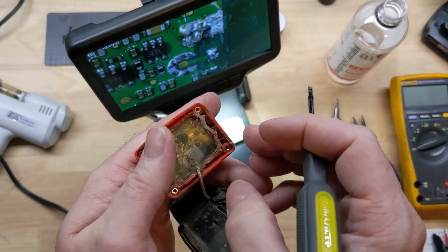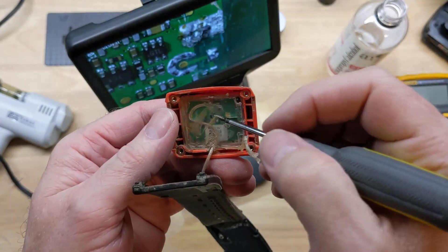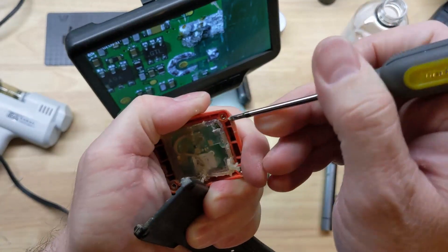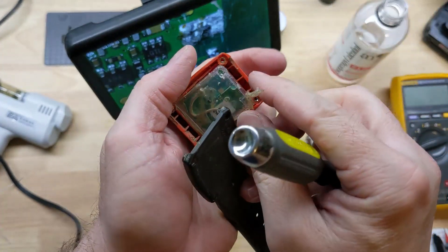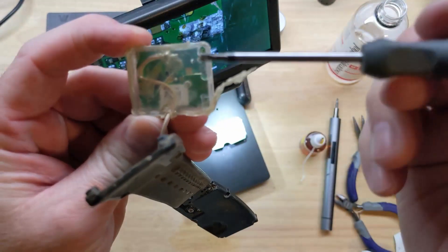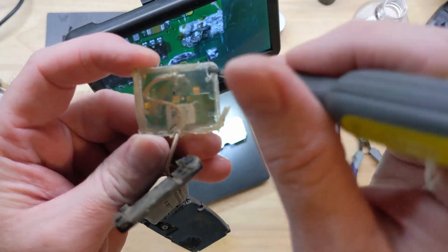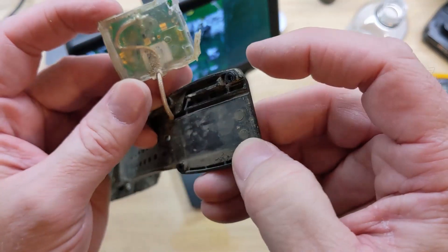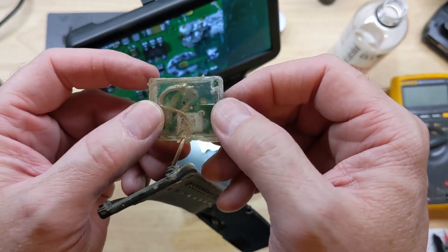Off camera, I went around with a razor knife and some small screwdrivers to get to this side of the coax wire. I finally put a hole through what seems to be a little encapsulated board here — it does not appear to be just potting. I think it's totally epoxied. There are some air pockets. I busted through an air pocket to pry, but just so you know, I don't think it's impossible to repair with small coax — but it might be very difficult to get to the board without destroying it.